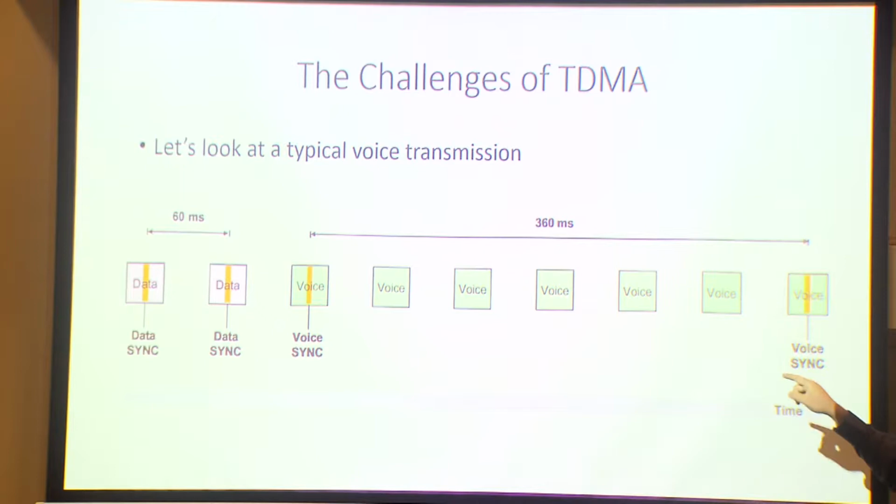Jonathan wasted a hell of a lot of time in the early stages, because his first MMDVM modem used the Arduino Due, which is what he ended up deciding on. When he first started off, he used the internal crystal for his timing, and it is crap. It's something like 10 or 15 ppm, while the ETSI standard specifies 1 ppm. That's what's in the standard, so you've got to be bang on. His bit error rates were all over the place. Things were drifting. He was ending up in different time slots. He had a hell of a lot of trouble.